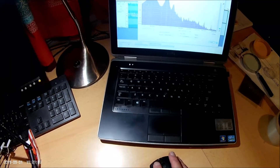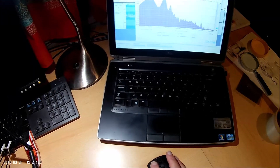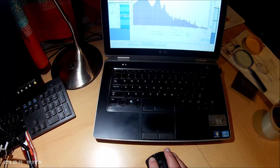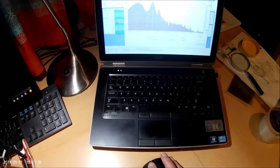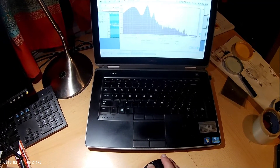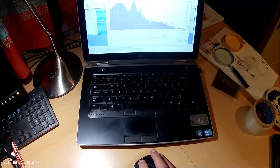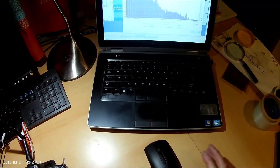What we're looking at is these sound peaks in here. There's a peak here which is peaking at about 98 hertz. The next one there is peaking at about 293 hertz. So from those I should be able to work out what the actual RPM is. There are various other bits of noise that show up in here as well — there's been a bit of comment on some of the stuff at around the 7000 hertz end of things.